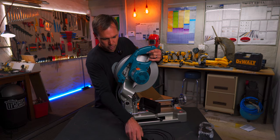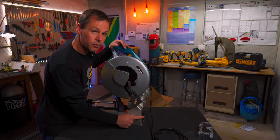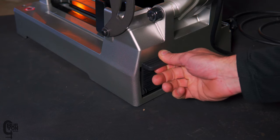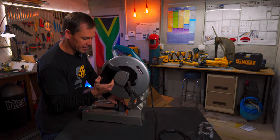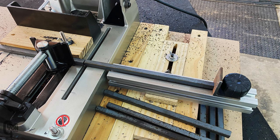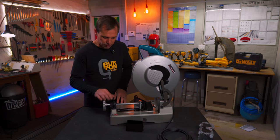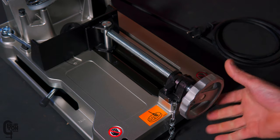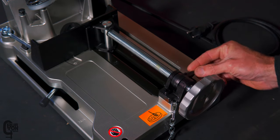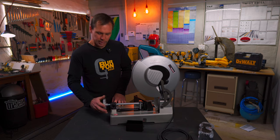There's a two-and-a-half meter power cord, which I'm really happy about. At the back, we've got a chip tray — a little steel tray with a rubber handle. When cutting, chips are flung backwards into the tray. Although it won't collect everything, you'll still get a bit of spray to the left and right, but nowhere near the mess of a comparative abrasive saw. Like most other chop saws, it's also got a quick release function — move the lever anti-clockwise to pull out the locking vise, put your stock in, turn it clockwise, spin the wheel to tighten, and you're good to go.